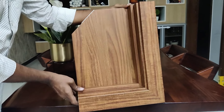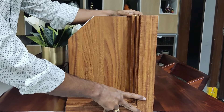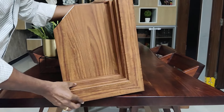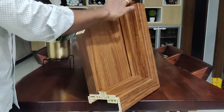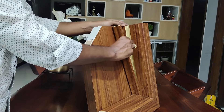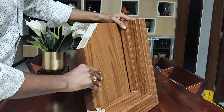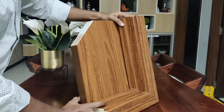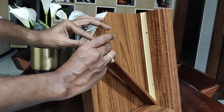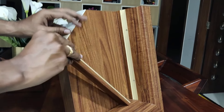Next comes the frame, and it is 120mm in width. As you can see, there is another component in the frame called the jab. The functionality of the jab is twofold: one, it will help stop the door movement beyond this point, and secondly, it conceals screws that will be used during the frame fixing. The screws are meant for additional strength, which is very much needed for high-rise buildings.